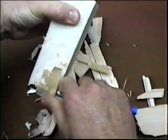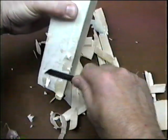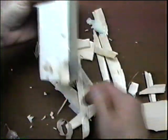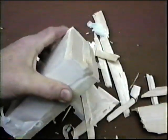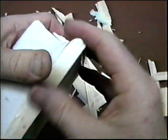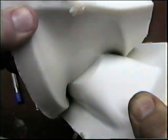I'm going to try to cut as little or none of the rubber away as I can, of course. And I definitely would like to save the base plate. That's my objective here. Not to ruin that base plate. At the point in time you get to where it starts to release off the part, little by little, I'm going to take it nice and easy. You can see how it peels its way up.